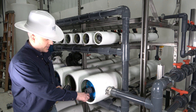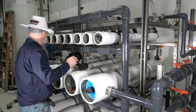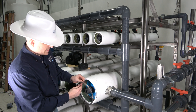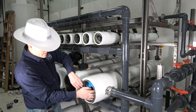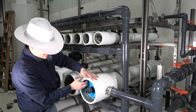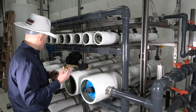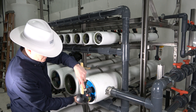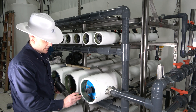We've got space now to go ahead and reinstall our snap ring. You'll see the snap ring can bend and fold out — go ahead and take the piece and get it started up in that little slot. Some snap rings will not go in that easy. You'll end up taking a flathead screwdriver and working your snap ring around until it fits into its spot. Sometimes you'll have to tap on it to get the snap ring to fit in that groove really well. You may or may not have to do that — just want to give you a heads up.